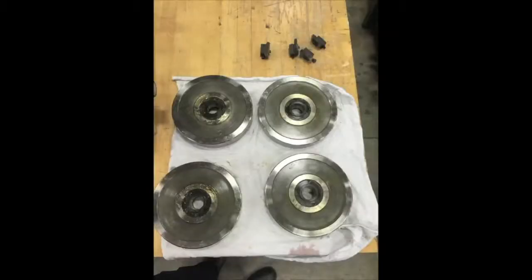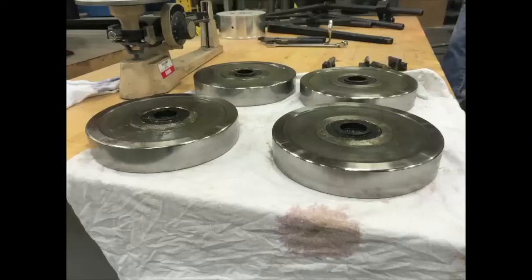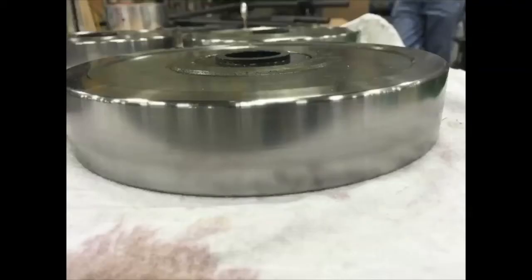These are the typical hard rollers that support a shaft during balancing operations. They are designed with a crown to avoid edge loading, but still are capable of damaging or marring critical surfaces on the rotor.